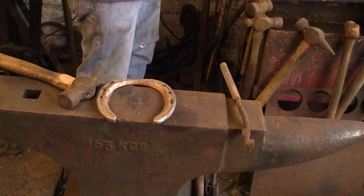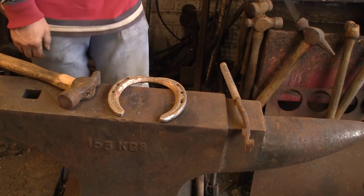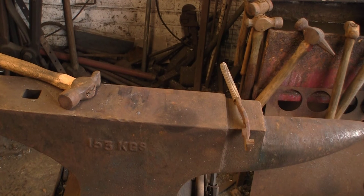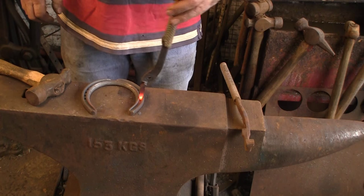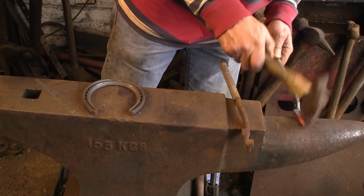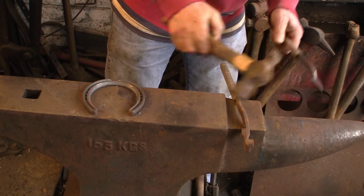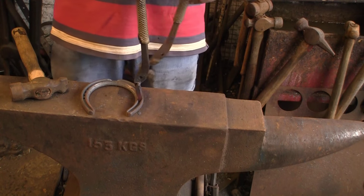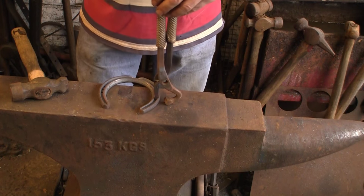To compensate I want to bend that bottom bit under so it brings the top up, because it gets worse as you go further because of the pitch. Generally you carry with the heel nail hole anyway - that nail hole should be dead upright, but these are machine-made shoes and they're not always upright as you can see. So I want that one upright or fairly upright when it's actually gripping. Let's bend that in and see if we can get them more upright. That's better - that's the way I want it.